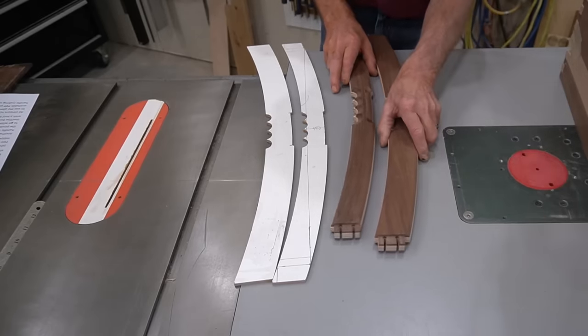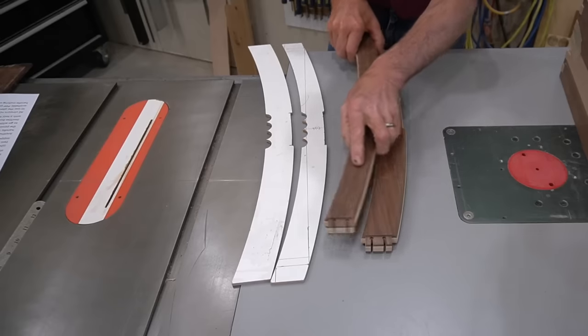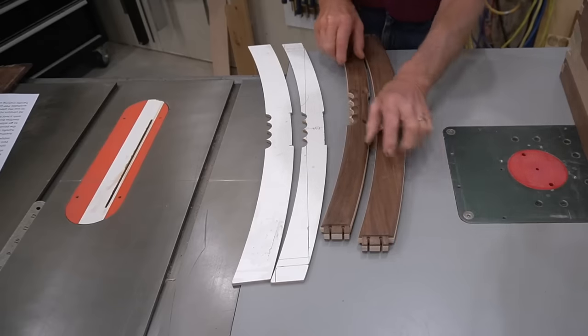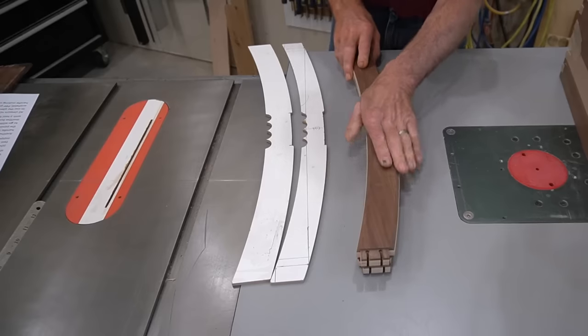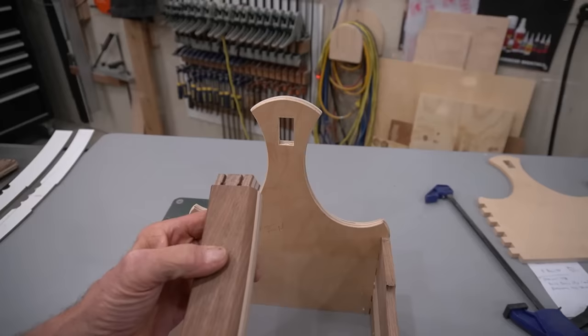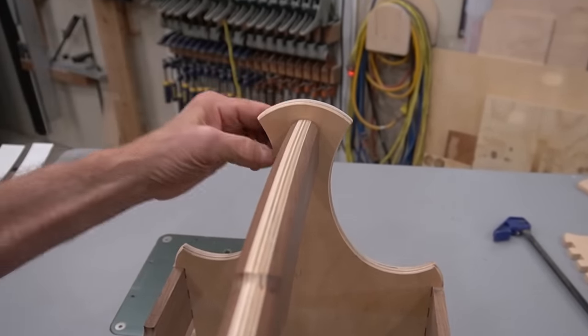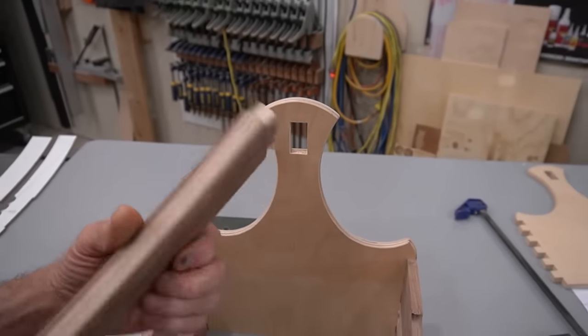Since I couldn't avoid the problem after finding it, I had to make a new, wider template and three new handles 2 inches wide, using all the same steps shown in the video to this point. With these two simple alterations, the new wider handles will cover the mortises in the ends of the tool tote like they're supposed to in the first place.